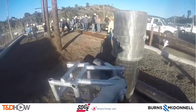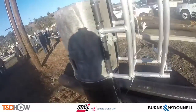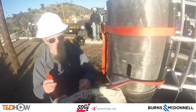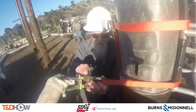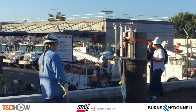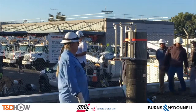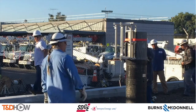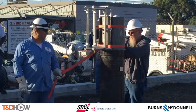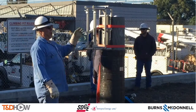The first step is to place and then strap in place a cage that goes on the pole butt. That cage is going to hold a pole gin that we're going to put together in order to bring the sections of the composite pole into place. You can see the strap on this cage. If they are in the field with an existing or standing pole, they can also rig off of that, but for training purposes we are going to show the use of a pole gin to assemble this pole.